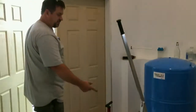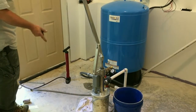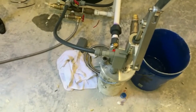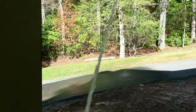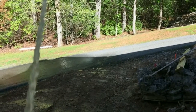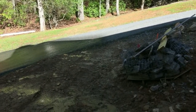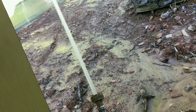They put a one horsepower or a horse and a half pump on a 10-gallon dumb bladder tank, so that pump is just cycling — real fast cycle, it's ridiculous. On and off, on and off. This thing used 400 watts to pump 50 gallons of water to 60 PSI. We've been blasting out the water here, there's a lot of water. I just want to know there's a hiccup at the bladder tank — dialing in the pressure switch. It's closed. You still got pressure? We lost it — so we need to dial it in. Now it's coming back. We've got to dial that pressure switch in. You going to dial in the switch or dial in the bladder tank?